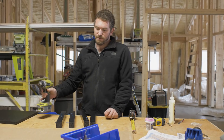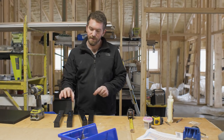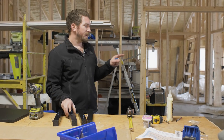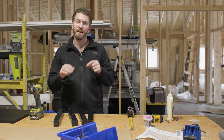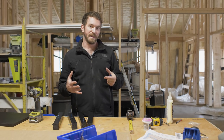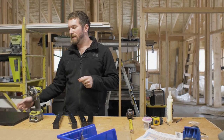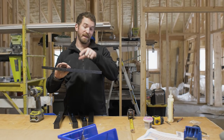I'm getting the screws started on these supports using a two-inch exterior grade screw, which is enough to go through the supports and into the plywood sides. I'm going to set these supports down enough to accommodate the bucket that my plant is in, which is about thirteen inches. Those supports are going to support the shelf that the plant will sit on.